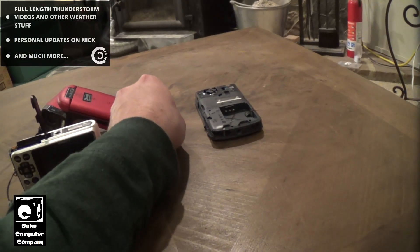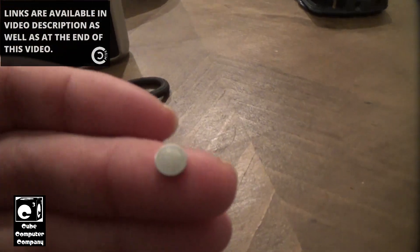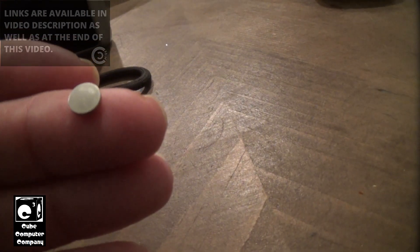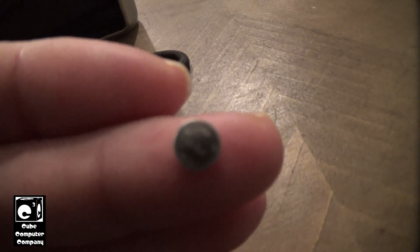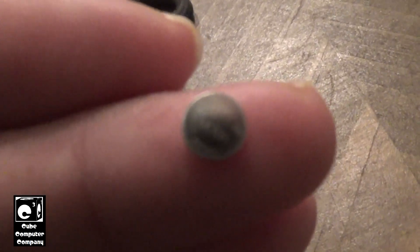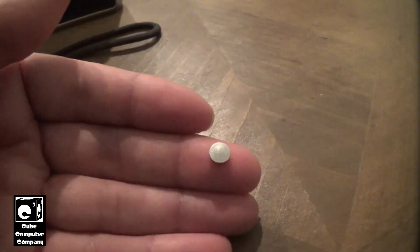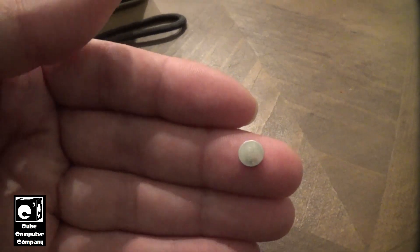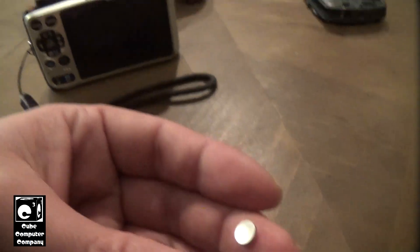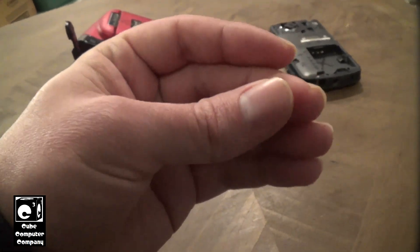Well, it has to do with a little bitty cell like this right here. For example, this is an ML621 — it's a tiny little thing. And these little batteries — it's a rechargeable lithium-ion cell, a 3-volt lithium-ion cell actually — that's typically buried deep inside the camera. So when it dies and doesn't take a charge anymore, it's very difficult to replace.